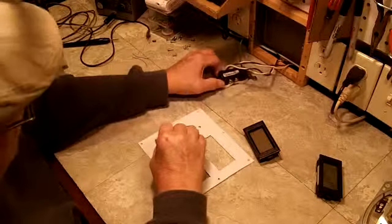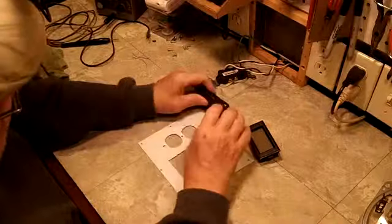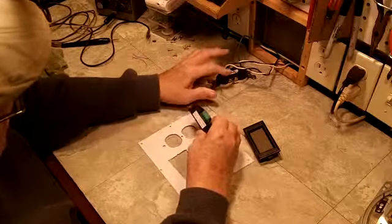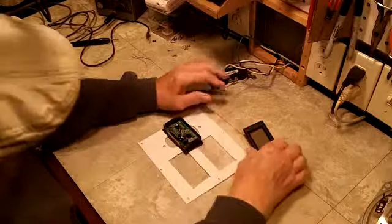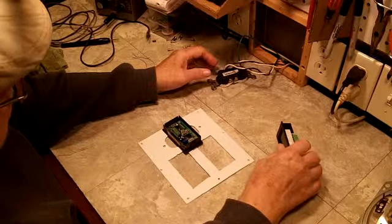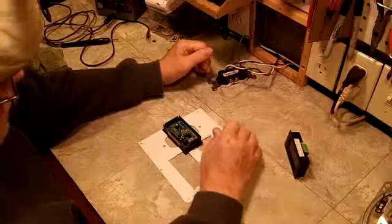What I'll probably do is run this wire here right into the ammeter, and then run a wire back out of the ammeter from here over to that, and connect another wire from there to the terminal on the input for the voltmeter. That will just leave one wire running from the neutral side to the voltmeter, so it's pretty simple to wire.